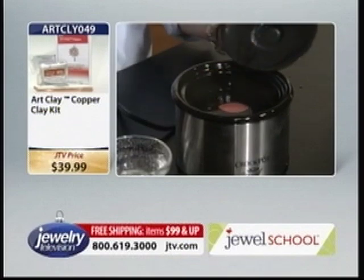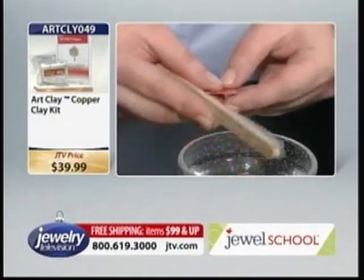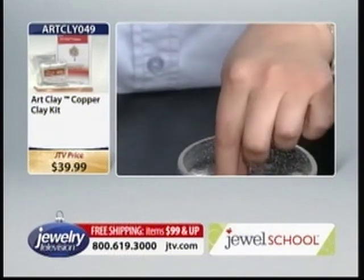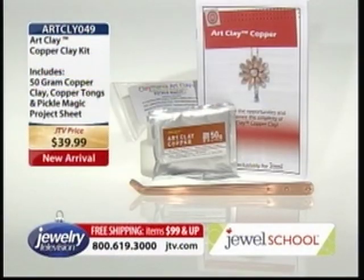You can keep using the same pickle over and over and over again. I've had pickle last a week. And then all you're going to do is once it's pickled, that takes off the oxidation, and you're going to get that beautiful, coppery color coming through.